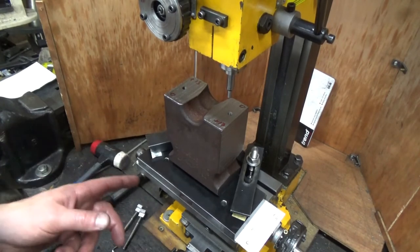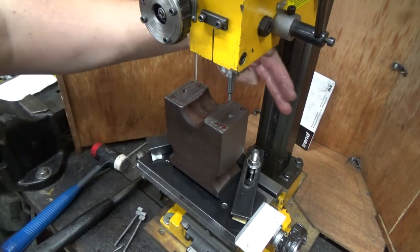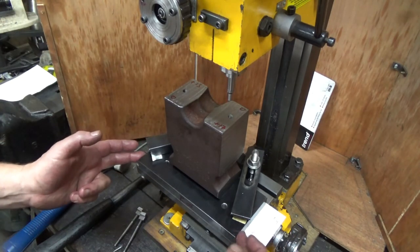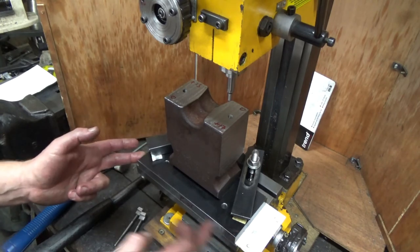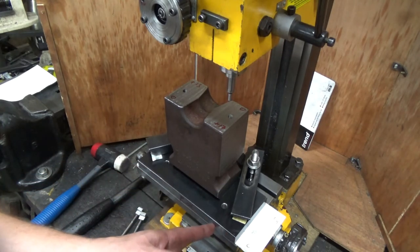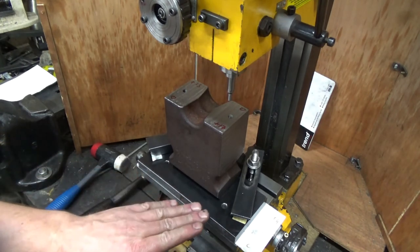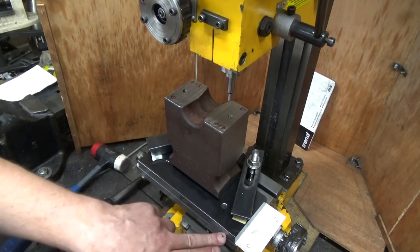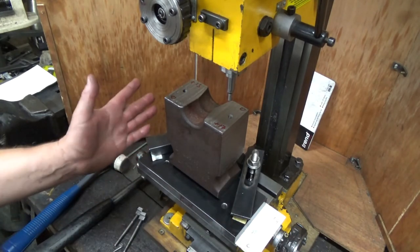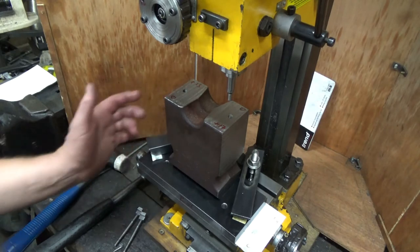Alright, now it's back on the other way. I measured from end to end on the other side, and it's bowed in the centre. And then I get a 3 thou end-to-end variation on both sides. Now I measure this side end-to-end, and it's more or less flat all the way down, apart from a little bit around about here. You can see where I milled all of this in one, and then I milled that after. Anyhow, that is more or less level all the way down, apart from a little defect here. And I get 4 thou end for end. So these sides were never parallel to that end. So I'm guessing that end was off.